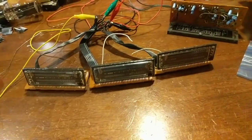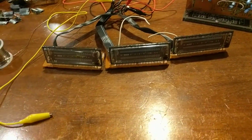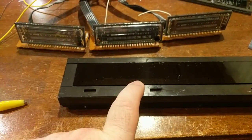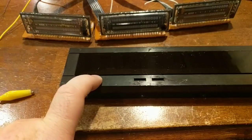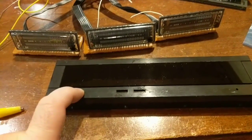Okay, but I also want the Raspberry Pi to be able to go in a standby. So, for example, I have these 3 buttons here. These are probably going to be volume up, down for the power amplifier, and this is going to be power. So when I press and hold this button, it'll power off. Maybe tap it once to mute, press and hold to shut down.